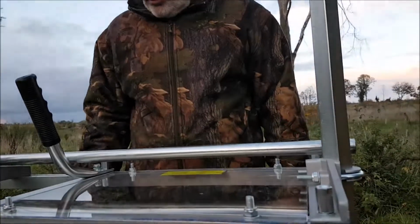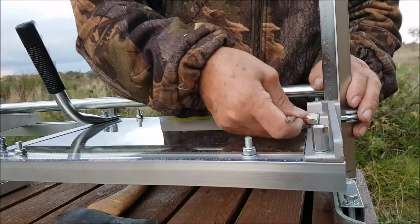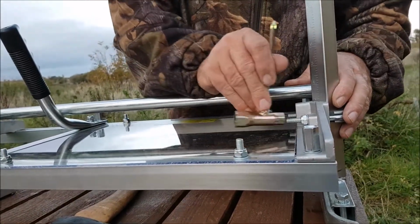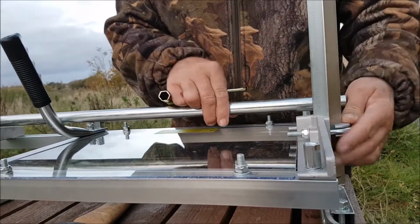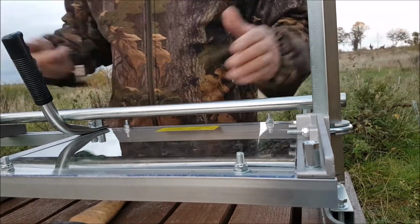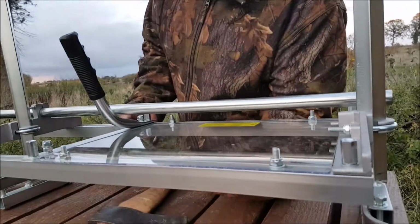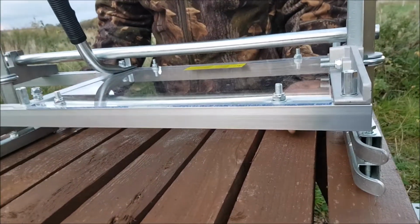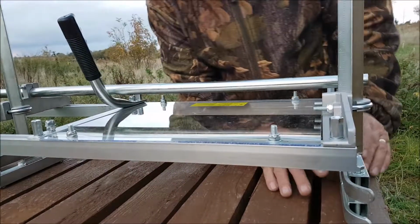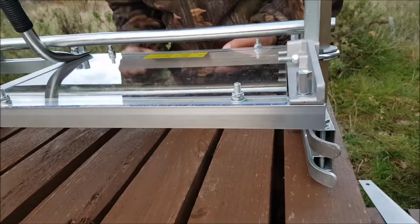Oh, one, it's cold. And two, this is your height adjustment. So when you've got it on the log, ready to go, you lift them down a little bit like so, undoing. And you can see this will go higher and lower. Same at this end, so then you'll get it level. So when you're pushing across, this surface here will sit on the log eventually. As you're pushing it, this will determine the diameter from there. You imagine this is your blade, so your blade's here. From there, this will be to the bottom of this.